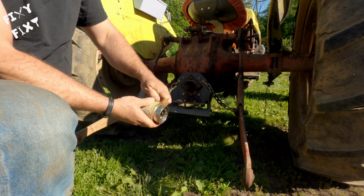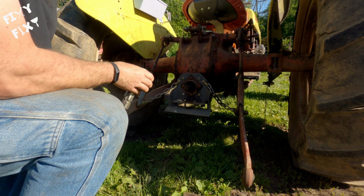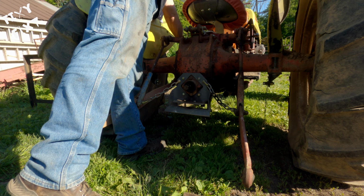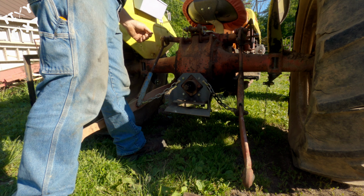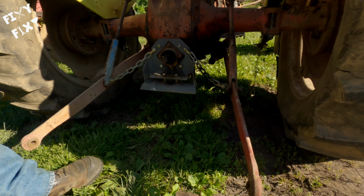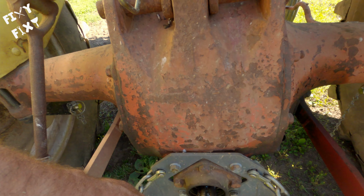I do take this off anytime that I do not have a PTO item that I need to run with it on. I don't like the fact that I can't put the PTO cover on while the overrun clutch is on. So since I need it, I'm putting it on. When I'm done with this deck, I will be taking it off.